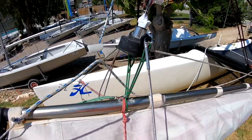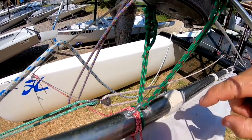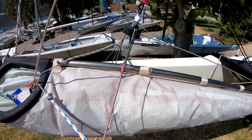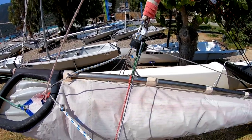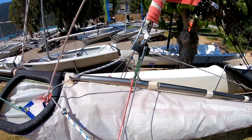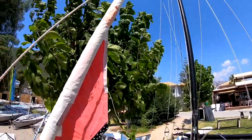We have intermediate bridles which support the middle of the pole, and in the middle of the pole this is where all the interesting stuff is with the furler. The fore stay attaches to the end of the furler. From the ends of the bridle wires we take a rope through the tang on the bowsprit and up to the other side so it's even, pulling a small amount of tension — putting a very small bend into the bowsprit. That bend means when the spinnaker is under pressure the bowsprit will never bend more than straight. If it bends upward like a banana, that's when you could snap your pole. At the top of the jib there's a swivel so it can rotate at the top as well.